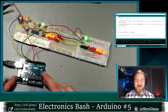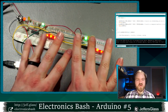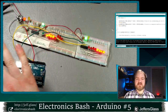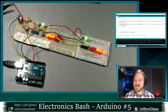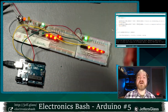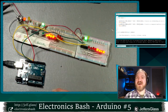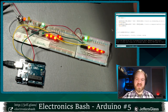So now we have the Arduino outputting 16 bits of information and then latching them all in at once. We have this alternating pattern, and then we have this 4 and 4 pattern here. So the Arduino is clocking out 16 bits of information, then latching that in, then clocking out 16 bits of information and latching that in. That's the gist of that send int out command. And again, you could write your own code that clocks out 20 bits or 24 bits, maybe 3 bytes of information, or 48 bits of information if you had 6 of these shift registers. I'm going to need 2 of them, so I have written a function that outputs 16 bits at once, and I find that storing 16 bits in an integer like that is a really handy way to do it.